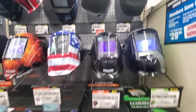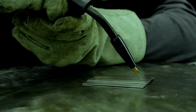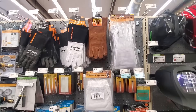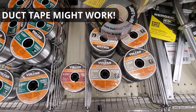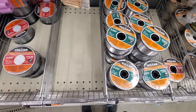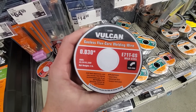Get the auto-darkening helmet, not the cheap fixed shade right next to it. The auto-darkening allows you to look through, get ready, start the weld, and as soon as it sees the arc it will darken — just like the name — so you can keep seeing what you're welding without hurting your eyes. You're melting two pieces of metal together, so pick up some welding gloves; you can get a three-pack for 10 bucks. No Harbor Freight welder comes with wire anymore, so pick some up. Make sure it is not solid core — that's for MIG welding. Don't pick up aluminum either; you want flux core or gasless flux core welding wire.